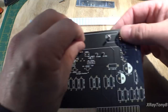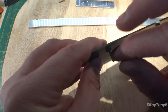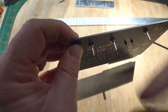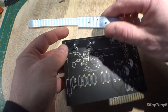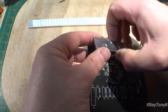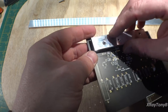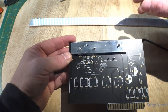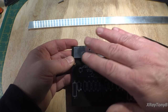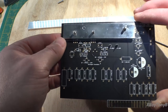What you're going to do is mount those screws like this, then put a nut on the front side. That gives a little bit of spacing off the board to allow better circulation of air around the heatsink. I used a larger drill bit or countersink to remove any burrs from the holes — that's important, because a burr will hold the transistor up off the heatsink. Make sure it's nice and flat there before mounting. Then we're ready to mount the transistors.